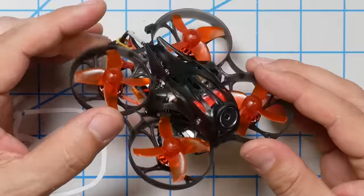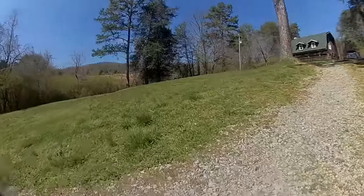Like all brushless quad copters today, the ESCs on the Mobula 7 HD support DShot, which means they support DShot commands — specifically Turtle Mode. Turtle Mode lets your quad copter reverse its motors and flip itself back over when you crash and it's upside down. This is just a lifesaver — great for getting yourself out of trees outdoors, or flipping it over from under the couch indoors. It's one of the biggest reasons why brushless Tiny Whoops are better than brushed ones. Having to walk over and pick them up is so freaking annoying.